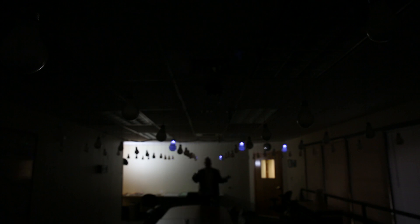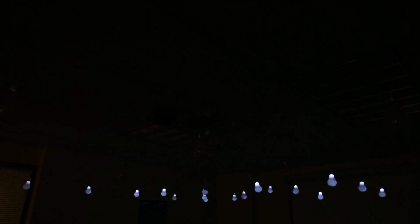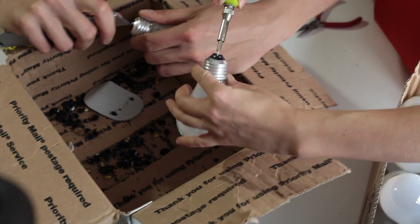In the future, I could easily reprogram this whole thing to use these sensors to detect when someone walks into the room, or whether someone on one end of the table is standing up or not — all sorts of things you could do as long as you have a network of sensors in place. Right now I'm using the ultrasonic range finders as well as our Spectrum Shield, which is another sensor I'm using to take the music input from the Bluetooth module and chop it up into frequency bands so I can display it on the light bulbs.